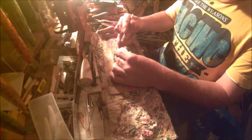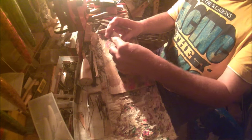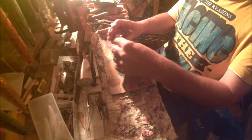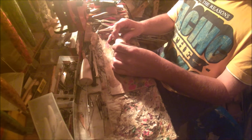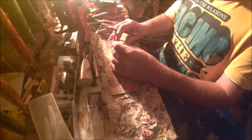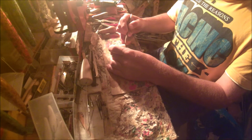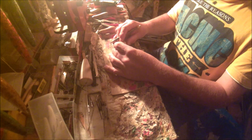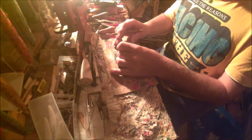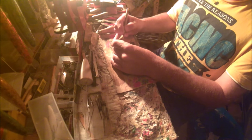Okay, I said in part one I'm doing all this by eyeballing and experience. Okay, here's the marker line at half of the entire length of the body, of the head section, sorry. Now, I check for the wood grain, again like the belly hole, crosswise to the wood grain. This is my reference line, I would make this one into quarters.